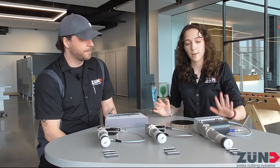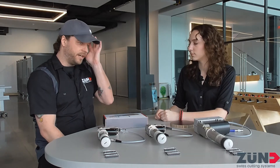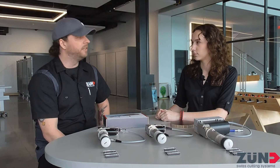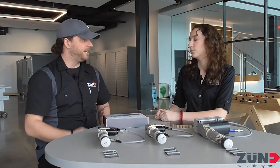The next one is a lot bigger — it's the 250. Other than the stroke length, it's stronger, so you can get through denser materials. It can also accept thicker blades. The EOT 0.5 and 1.0 use 0.6 millimeter thick blades only, but the 250 has a shim you can use and naturally has a 1.5 millimeter slot. Having stronger blades means more stability, so less deflection and flex around radiuses.